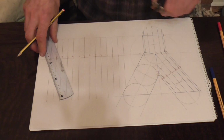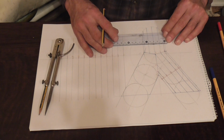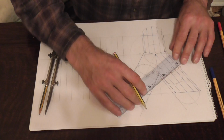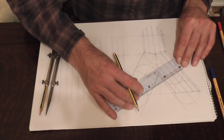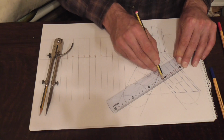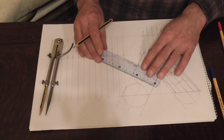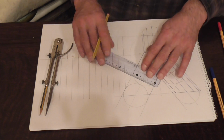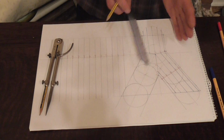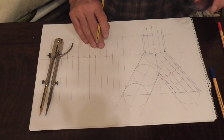Just before we start joining that in, I'll just prove to you that there's no distortion. As you can see, there's 60mm, no distortion there. Come across here, again, there's 60mm, there's 0, there's 60, no distortion there. And again here, 60mm, no distortion. So you know that this is perfectly aligned and straight. So now we can do our pattern on here.